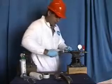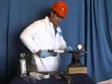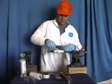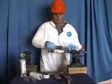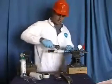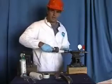The full cure will take 30 minutes. Within 15 minutes, the composite sleeve will become hard. After 30 minutes, the compression film will need to be removed and the application will need to be painted or coated with a pre-approved pipe coating. This will protect the composite wrap from UV as well as atmospheric conditions.